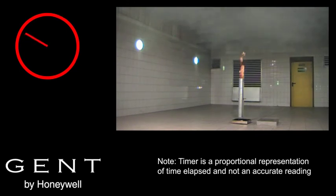A lot of smoke is produced with a paper fire, but under test conditions, the detector does not go into alarm. The smoke is prevented from reaching the detector by a thermal barrier formed by a lack of air movement. In real life, convection provided by heating and ventilation systems creates the movement needed for the smoke to break the thermal barrier.